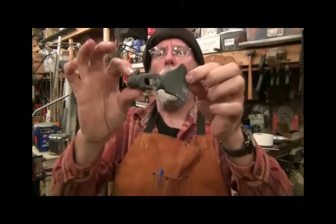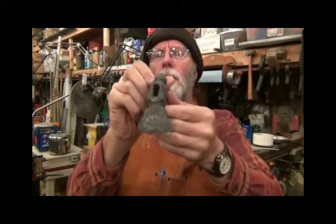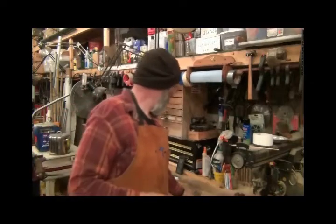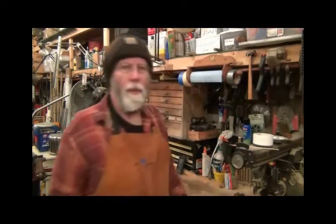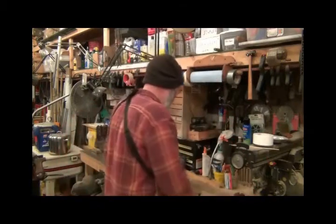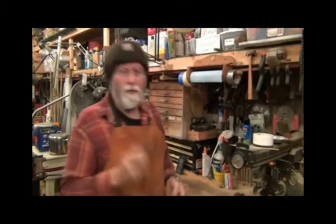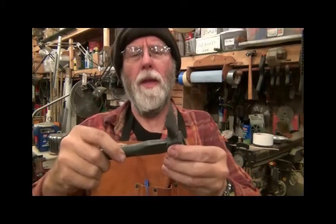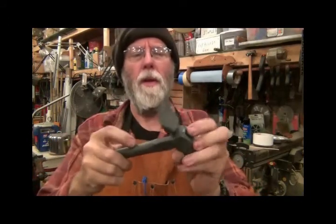I think I've got it pretty even and straight. I made a swage to drive in there and I heated that baby up red hot and drove this swage in from both sides. But it wasn't quite right — this is a little too small for the hammer handle I have. So I just finished making another one to drive in there and I'll try to get it drove in straight and true.